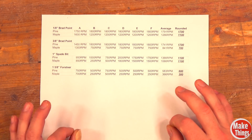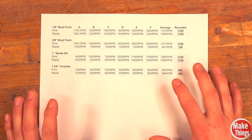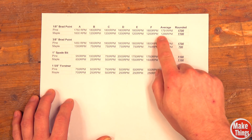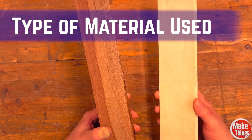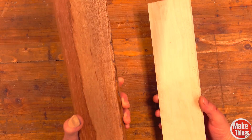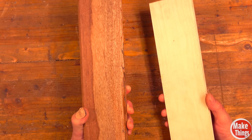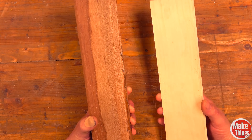The numbers are pretty consistent. The consensus is: the smaller the drill bit, the higher the RPM needed; the larger the bit, the slower the drill press should spin. Wood type also matters, as softer, less dense woods shear differently than harder, more dense woods. Generally speaking, the denser the wood, the cleaner the cut. Less dense woods have a tendency to tear as they cut.